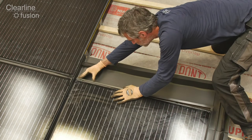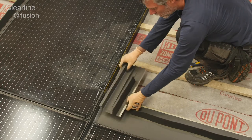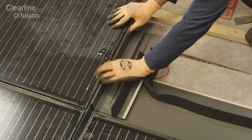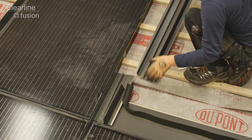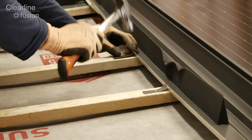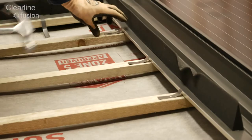Now fix in place the top flashing of the lower panel. Next, install the lower side flashing. Trim the foam to get the best fit. Set the bottom edge of the flashing to around 10 millimeters above the J strip fold. And now add the upper side flashing above it.